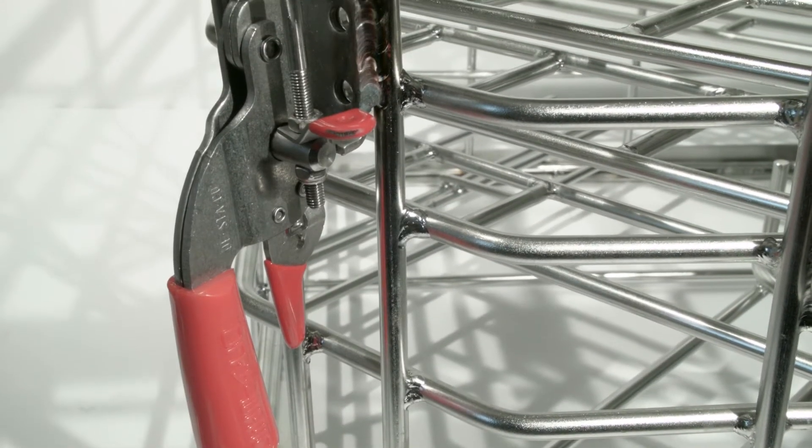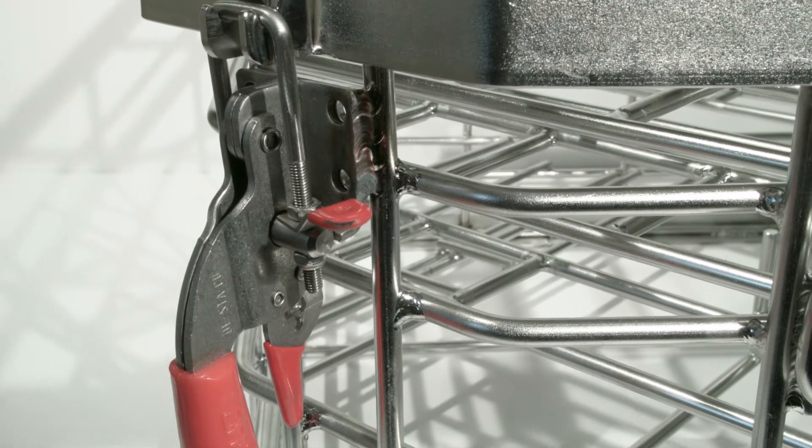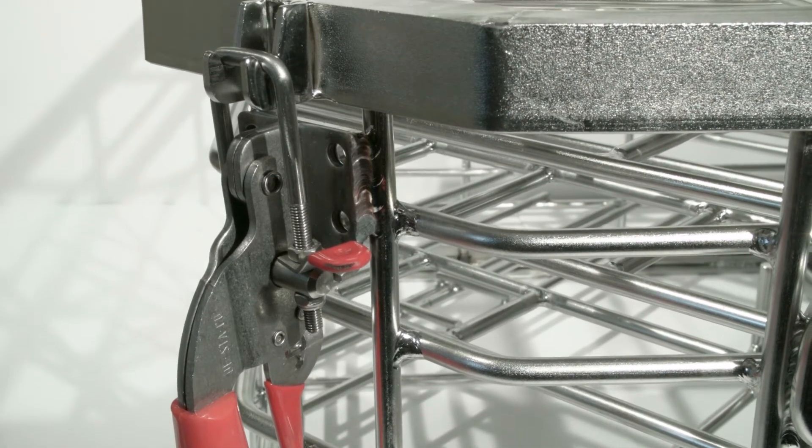The cleaning chamber was just barely big enough to fit all the parts, and the parts were so heavy they needed to be secured with a clamping lid. We struggled with how to fit large clamps onto the basket. We came up with the idea of angling the corners of the basket to mount two heavy toggle clamps inside of the rectangular work boundaries — space that would have gone unused.